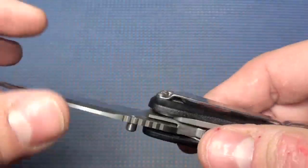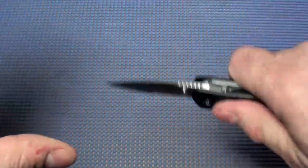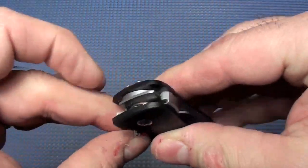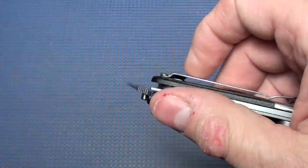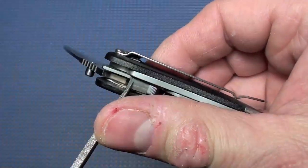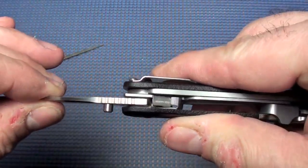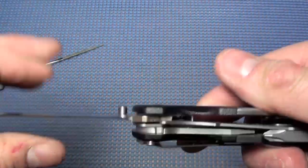It only does this now because after opening the blade and banging it down to try to get it to wear in a little bit more, and moving the liner purposefully back and forth — and another thing I did was once I opened this up, I moved the kicker over and filed this area right here down with this file so that the blade can come back a little bit further, to give the liner more of a chance to get behind the blade once it's fully open.